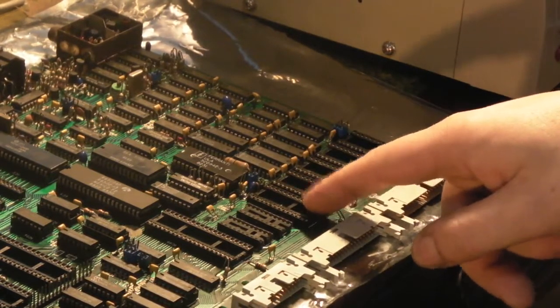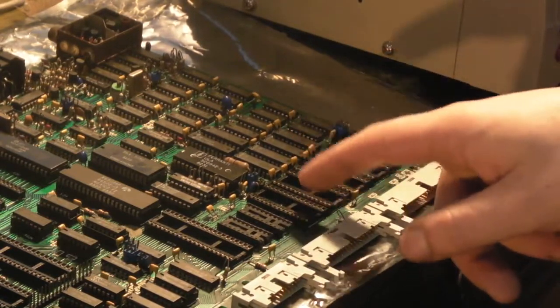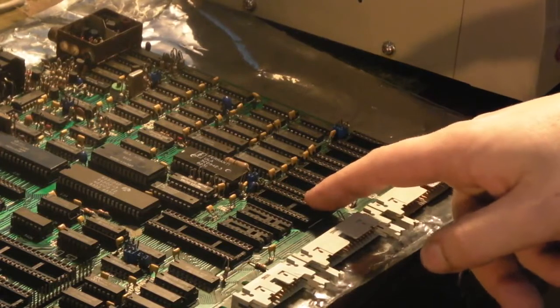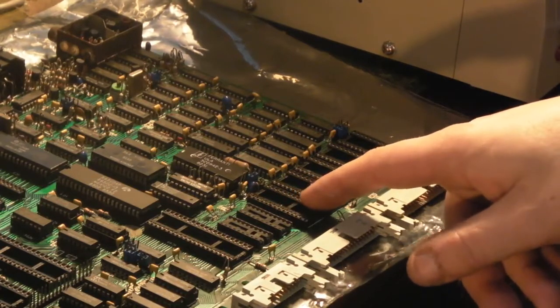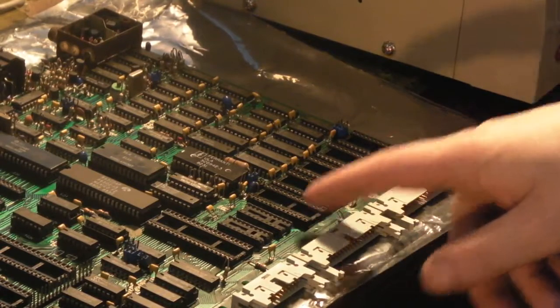He said to check whether the MOS ROM was actually working, which it is. I've tried that in my other BBC, and check round the socket. Now, these are the original single wiper IC sockets here, but compared to my working beeb, these sockets actually feel really quite tight.